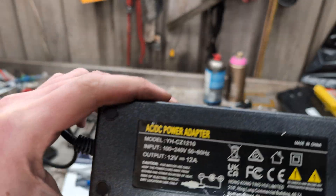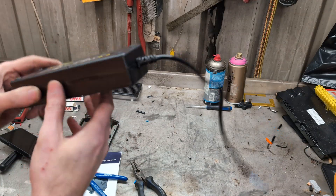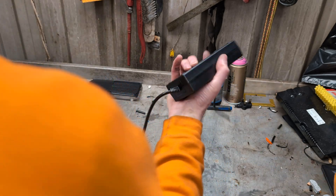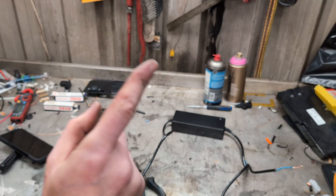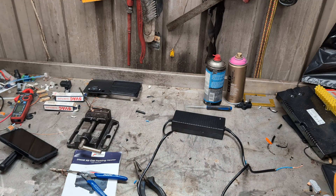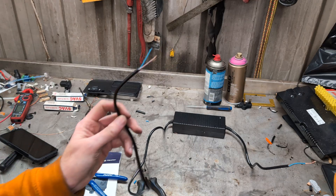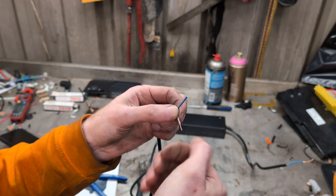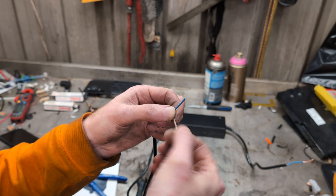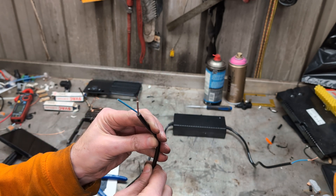This is a 12-volt 12-amp unit. It has done the thing and didn't melt or catch fire. But your mileage may vary — just because this one didn't melt the wires doesn't mean whatever batch or version you get hasn't got the same thinness in the wires. But this thinness — it took the load to run the diesel heater quite happily without heating up, which is nice.